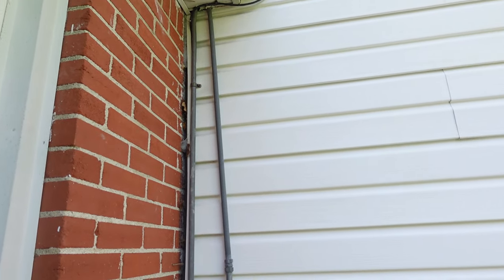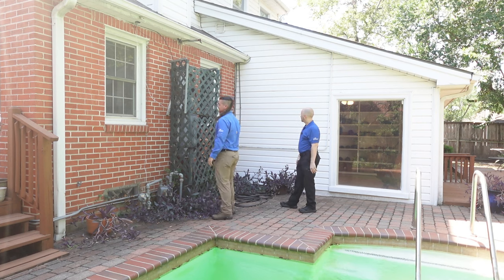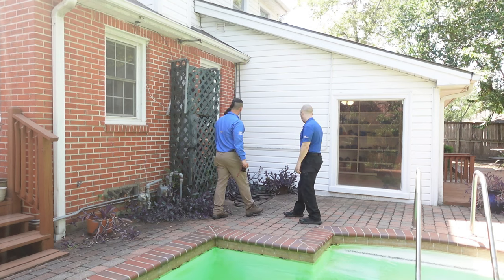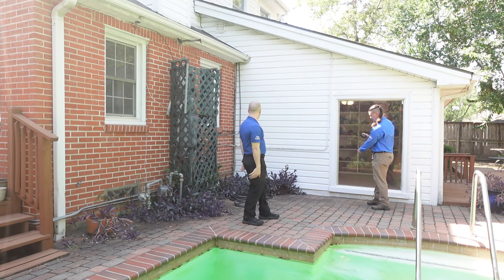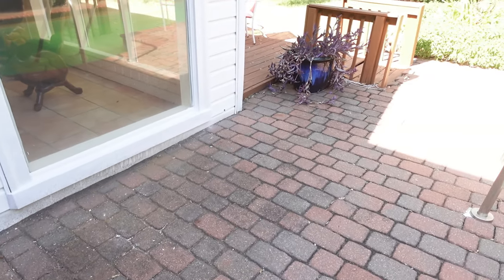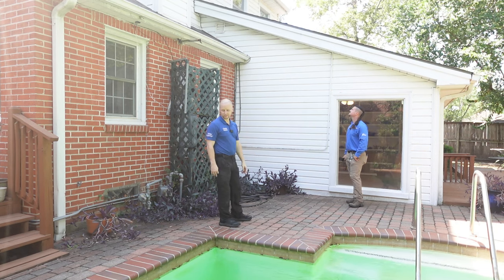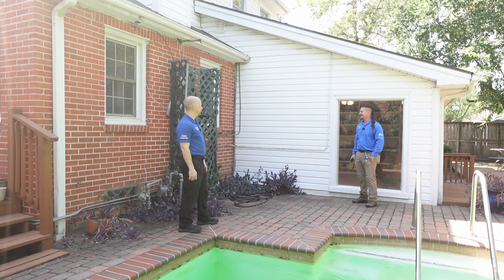From the settlement in the house or new addition, you can see it's separating with a gap from top to bottom. They've tried to caulk it and added mesh wiring — not adequate, that won't work. We also have grading issues — high grading all throughout the structure. You can see down into the floor over here, so any time it rains they're going to get water in that room. This property has water coming from both the top and bottom.